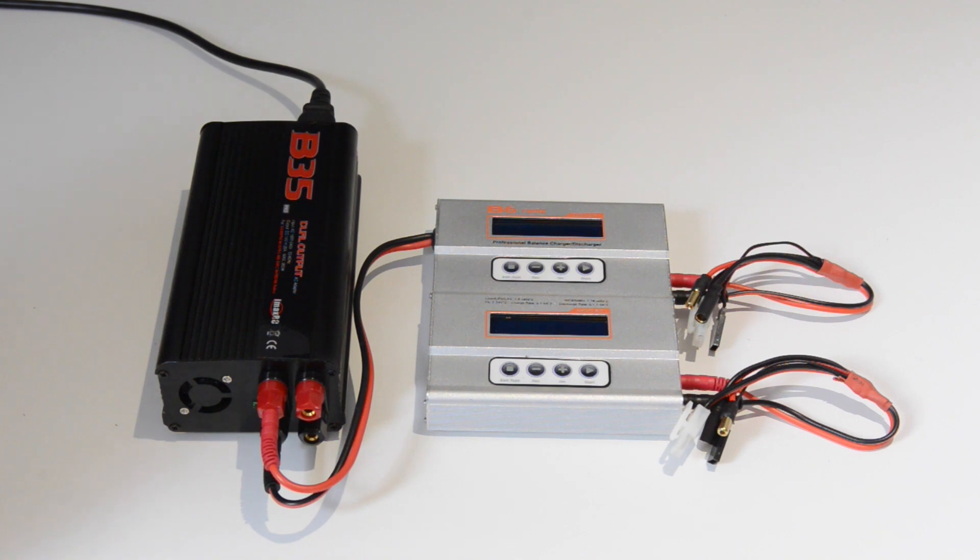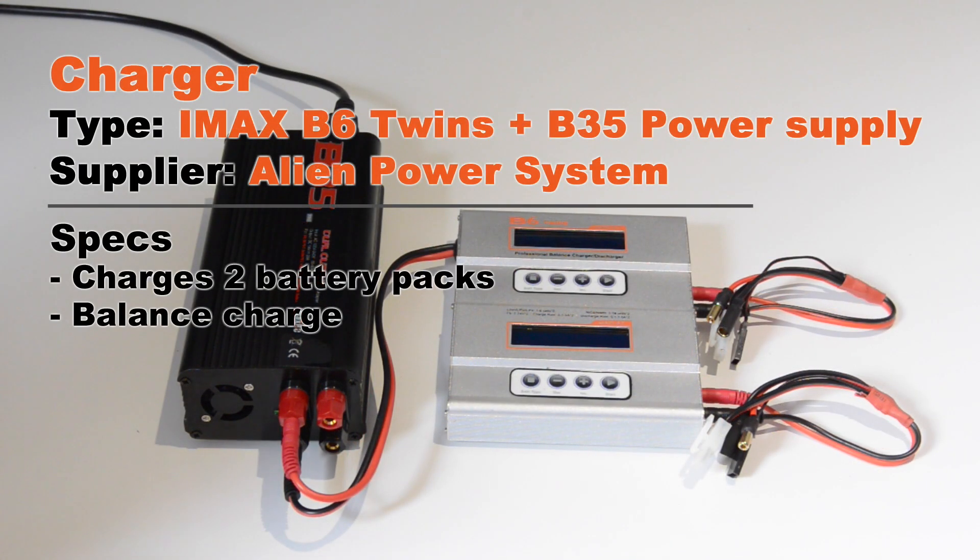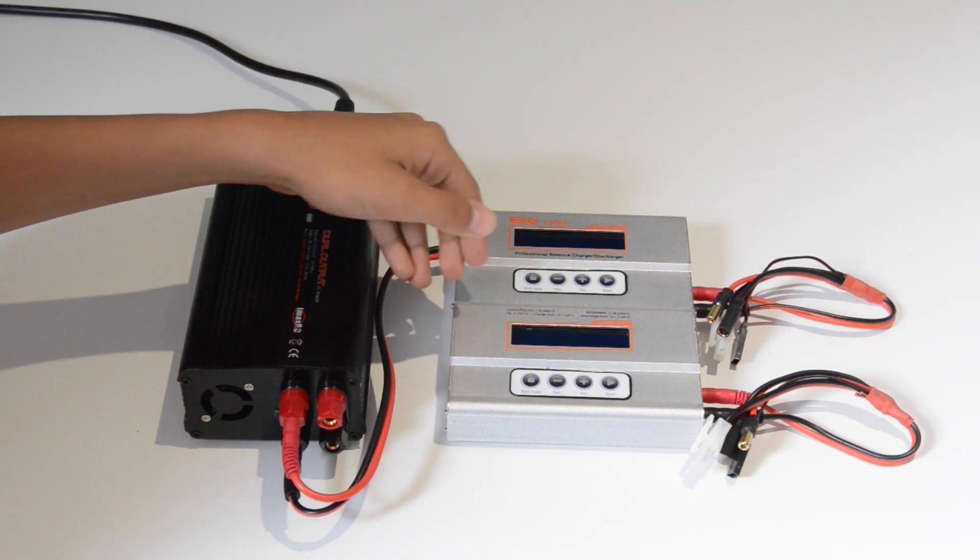There's one more thing you need before you can go: the ability to recharge your board. As we said, LiPo batteries need to be treated with care and respect. They don't like being over-discharged, but they hate overcharging even more — they have the tendency to catch fire to get your attention. We're not talking about overcharging the whole battery, but each individual cell. At the very least, you want your charger to check the status of each cell, ensure they are all at the same level, and not charge any cell over 4.2 volts. Most chargers require a 12-volt battery supply, which is why there are two components here. That's it — we've described in detail all the components of our electric longboard. In our next video we'll describe what we've learned and what we'll do differently next time.